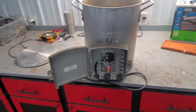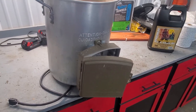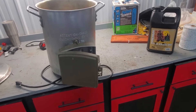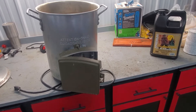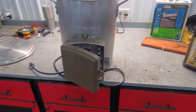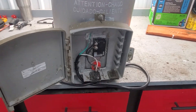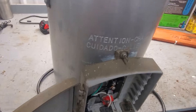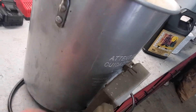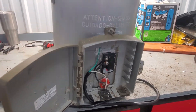The pot I had from years ago. This plastic box covering everything is just an old telephone line protector — the kind your phone company would put on the side of your house where the underground wire terminates and your residential inside wiring begins. This one was old and in the garbage, so I fished it out. I took a Dremel tool, cut the back out, and put a little silicone here so water sheds off and doesn't run down and short anything out.